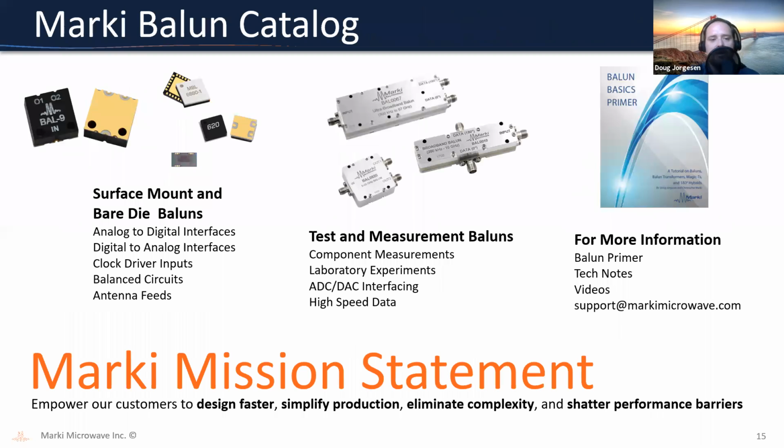If you look at our catalog on the website, you will see we break our Baluns into two different major types. One is what we see as system Baluns, so surface mount and bare die Baluns. These are for analog to digital interfaces, D to A interfaces, silicon, clock driver inputs, balanced circuits, push-pull circuits, and antenna feeds for things like phased array antennas. And the other type that we advertise is what we call test and measurement Baluns. These are all connectorized module Baluns that you would use for component measurements and laboratory experiments, chip characterization, things like that.